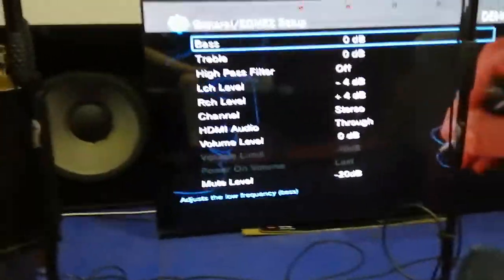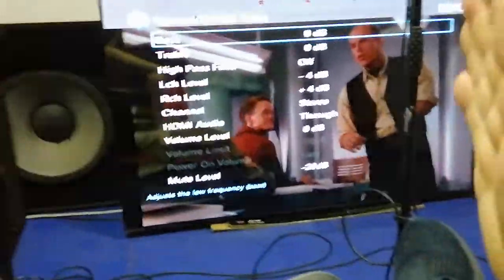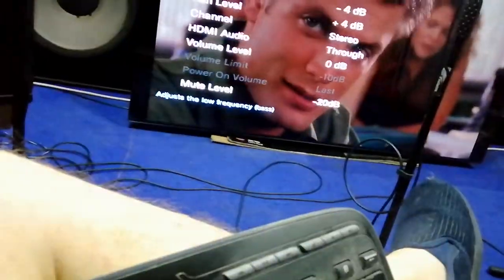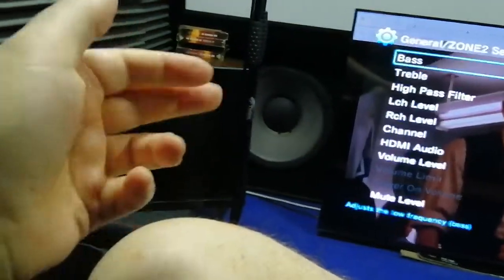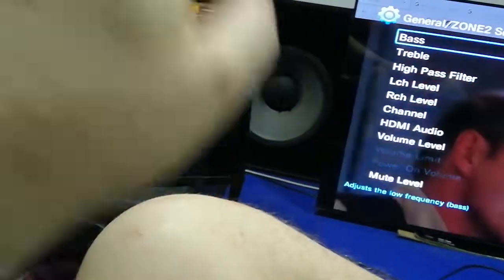Now, the Yamaha DSR 70 Pro that I used to have had a very simple left total, right total balance control to adjust. The trick is you mute your center, listen to any typical common center dialogue or sound effect, and if it's drifting over to the left or right, balance it out. There's another one I got, a Harman Kardon AVP1A, and that one's got an auto azimuth, or you can use manual. You can use automatic, and it does it pretty well. I remember using it many years ago, and manual.